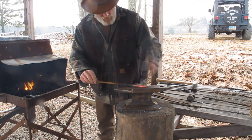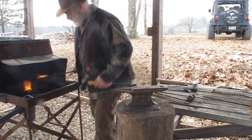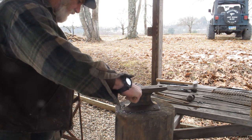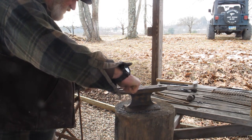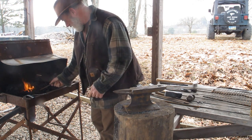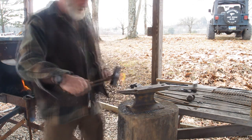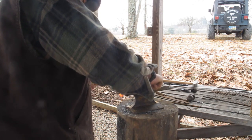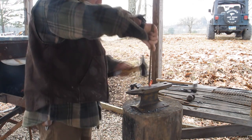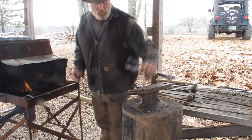I'm not going to draw this out too far, just enough to put my pigtail on it on this side. All we're going to do is work this on the horn, tight against the end as we can — heat it up. That's what's going to form our pigtail here. It's going to be really hot because it's a thick piece of rebar. Rebar is a medium carbon steel for the most part. You can see we're starting to get that turn. You want that turn to be pretty tight — it really only needs to be enough to get a piece of three-eighths rebar through there.